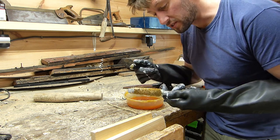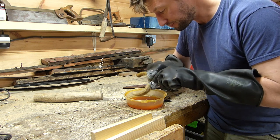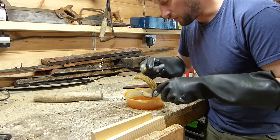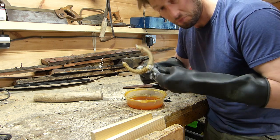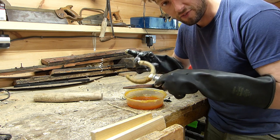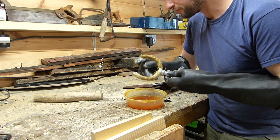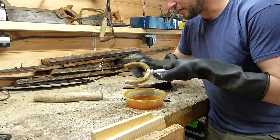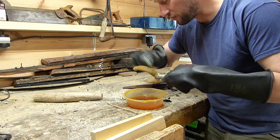And this is going to do two things. First of all, it's going to smooth down the actual fibres, make them less prone to abrasion, and equally less prone to rub down the leather on the actual paddle itself. It works like a weather protection, so it stops the fibres from being exposed to too much UV, prolonging the use of the fibres in the string. It also reduces the rubbing of the galvanising on top of the actual rowlock itself, so keeps the rowlock going a little bit longer. And it also works like a glue that sticks these fibres together and keeps them all intact and well stuck, so they don't start to unravel if one of the fibres becomes frayed.